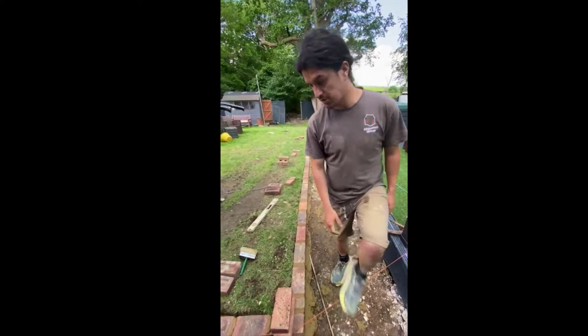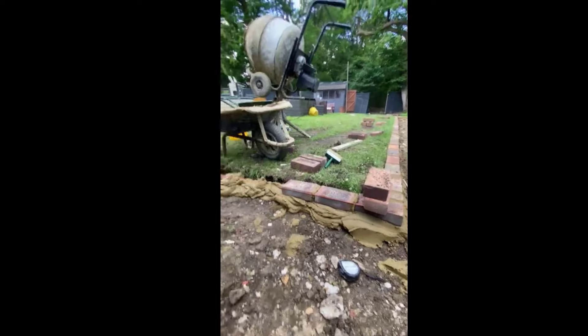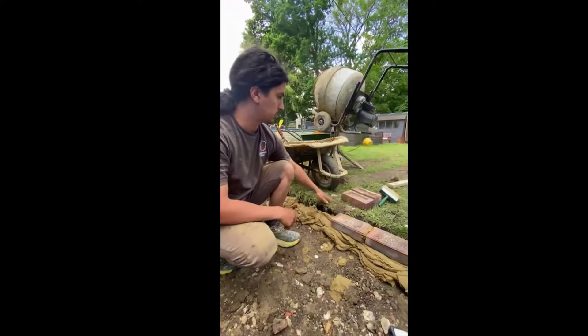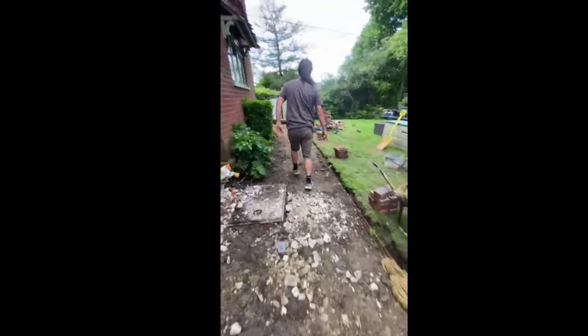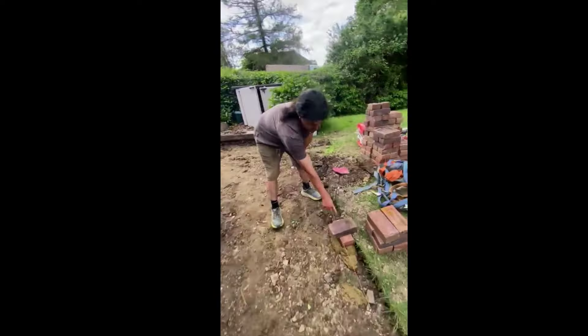It could be quite a nice contrast with the concrete hopefully. So I'm going to show you today how to lay these bricks to make a kerb, as you can see. The way I set it up is I take a line from where we cut out along the side of the garden. I've set the height there and laid the brick to that height so it just meets either just above or level with the garden, and then I come down here, set up and grab the brick to set the height, and that also meets flush with the garden as well.